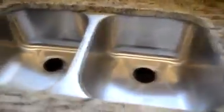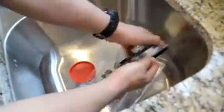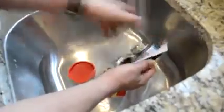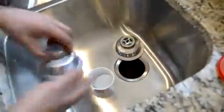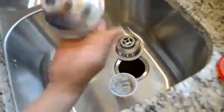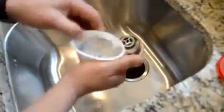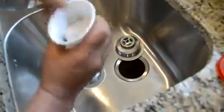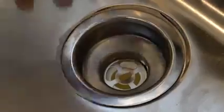To make it nicer, I'm going to show you the process, the steps that you need to take. The two strainers that you're seeing here are the same. We are not using a garbage disposer. That will be completely different. I may do a video about it, but in this case we are putting something called plumber's putty. The plumber's putty that I'm using is stain free. That means that for some particular materials, it will not leave stains on the fixtures. I will put a link in the description box, so if you want to get it, it's very simple.